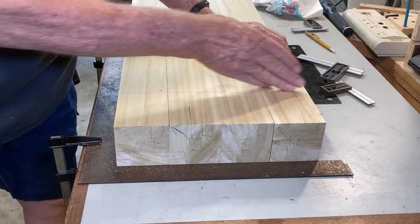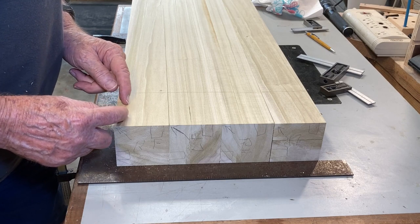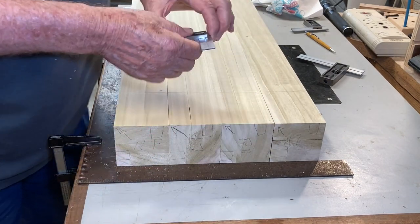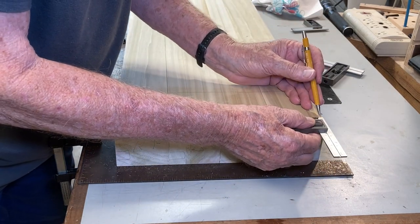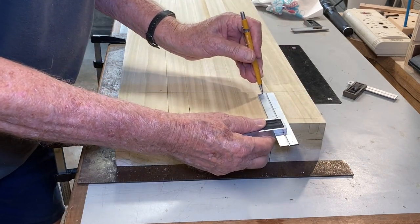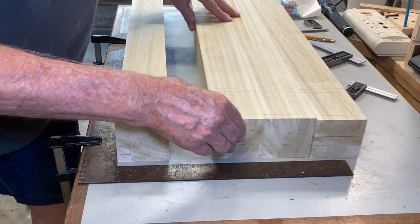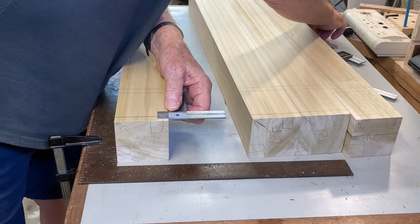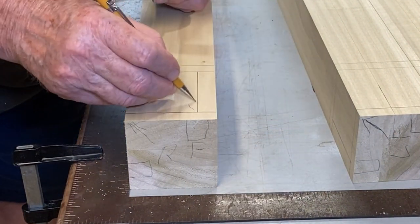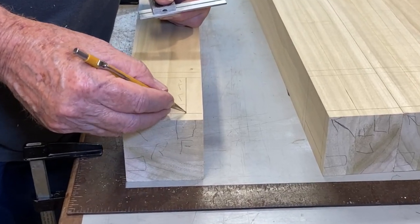Now I need to lay out the mortise. I've got the line for the apron width at four inches, but I want the mortise to be three inches long and five-eighths of an inch from the outside of the leg. My legs are in my square, which is attached here so everything stays square. The first mark is for the top length of the mortise, then I take another square to get the three-inch length. For the depth, I've got it marked where the tenon is going to go on each one — I'm using a half-inch mortising bit, so I'll have a straight line there.